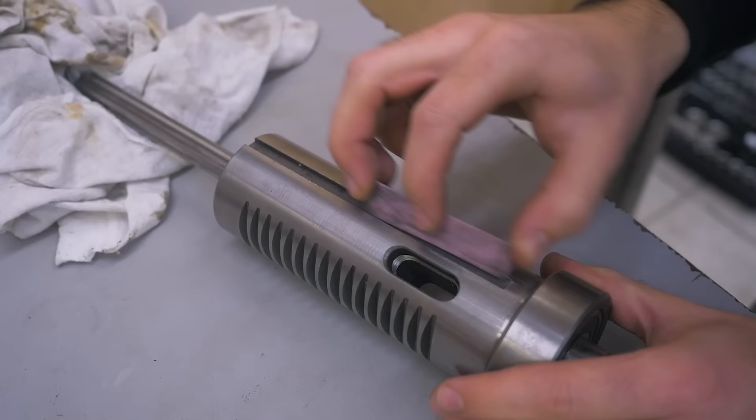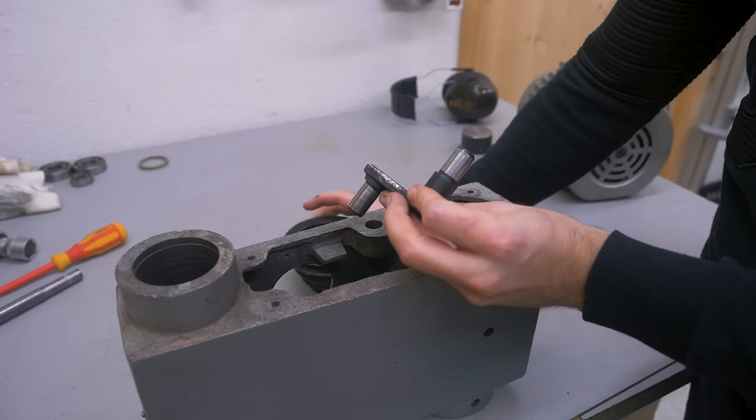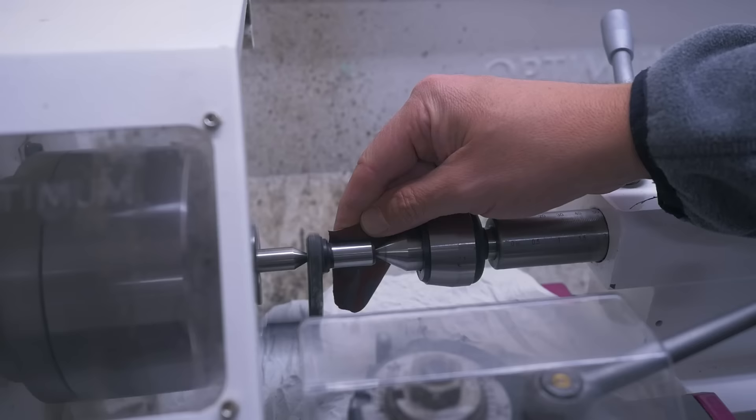There were also some bumps along the groove which I removed with a little grinding stone. I also replaced the bearings of this idler secondary pulley. But there's another problem — when I started disassembling it, it was moving pretty tightly. I thought that was because of dirt in the hole, but now that it's clean, it's still only this far in and pretty hard to move. It should move freely. I could chuck it the way it was ground initially and my dad then made it a perfect fit.